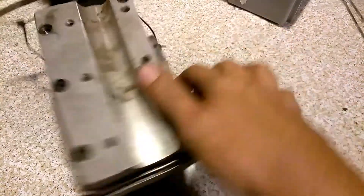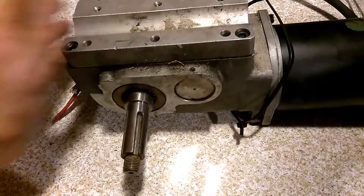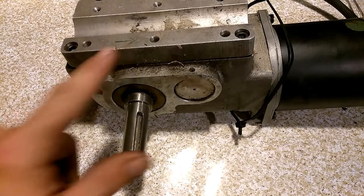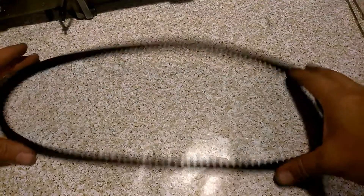So we're going to look at mounting this. Since the chain on the bike goes that way, we'll have this one on here going this direction — as you can see, I already drew an arrow showing which direction it'll be turning. I decided to go a little different. I'm not going to use a chain drive on this one, because I've been having problems with the motor having a lot of torque. So much torque it'll break a chain, because chains are only made for like one human power, and we're almost putting one horse through it. So we're going to go with a belt drive.